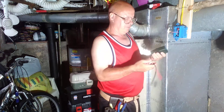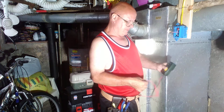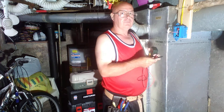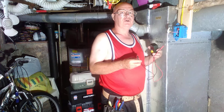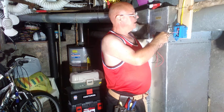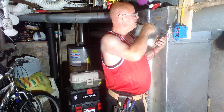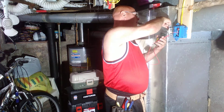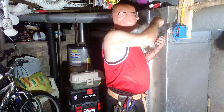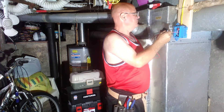Okay, so we got our power coming up to it now. For 240 or 220, we use a double pole breaker. From live to ground is 120, live to ground is 120, and live to live is 240.